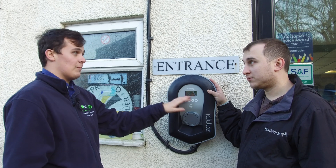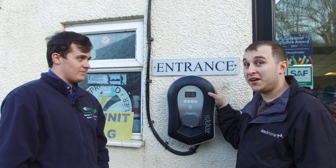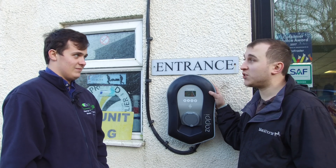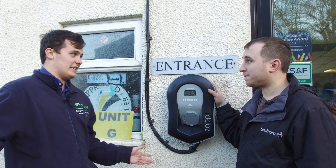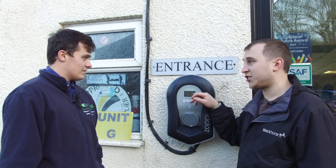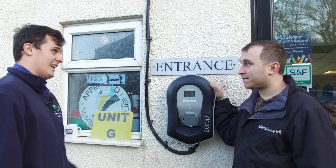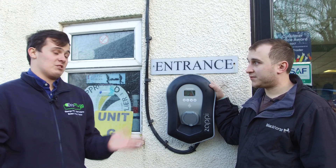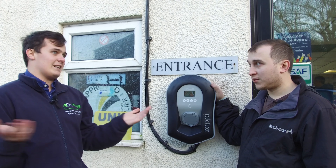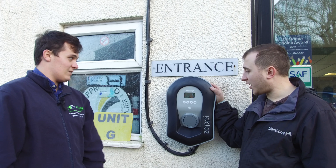When you get solar, there's eco plus mode and eco mode. That'll monitor your solar output and divert it straight into your car. For businesses, there's no energy company that will offer export for solar, so if you have a load of solar installed you need to use it all — and the Zappi is the way to do it. You just keep it plugged in all day and it'll charge up on the excess solar after your building's taken what it needs. There are also charge delays so you can set it to only come on during certain times. And there's a smart boost feature — say you're finishing at four o'clock and you want 20 kilowatts by then: it'll use solar until around three o'clock and if it thinks it needs to top up, it'll use grid power to make sure you've got those 20 kilowatts before four. Perfect if you need to go to the airport after work on a Friday.